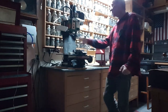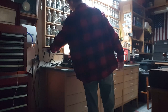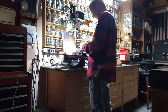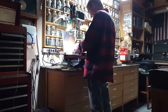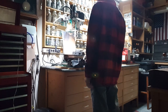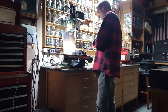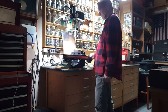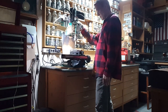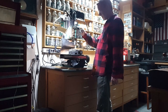Let there be light. My favorite aluminum end mill from Travers Tool — no burrs on the bottom, and it looks like it's going to clear that. The sawed crooked edge is up. Push them down — wow, they're like exactly the same height. Just need to clean up this side and then flip it over and clean up the other side. That end mill is big enough to cover both at the same time.